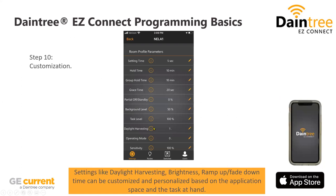At this point, this is the dashboard. It has a lot of the same things we talked about with the remote — you can set your times for occupied, unoccupied, and vacant, sensitivity settings, daylight harvesting. All of those same things are right on this simple dashboard. You can change any setting and it will send it up to the zone you're standing next to. You can also see the nodes you put in the room, the switches added, and the user account. We truly try to make this thing easy.